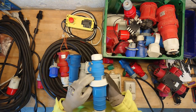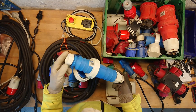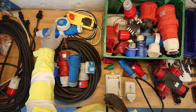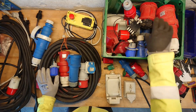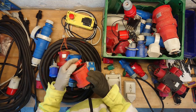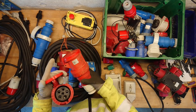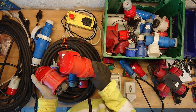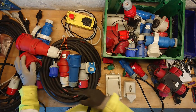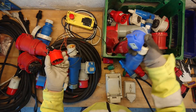That's pretty tight, but it also has to be to keep water out. Almost nothing will keep water out when you leave that outside — you will always get some creeping current to earth once the moisture gets into the plugs. Here's another 63 amp female plug, and another one. The next step up from the 63 amp plug is a 125 amp, and I actually do not think I have any 125s, as those are seriously large plugs.